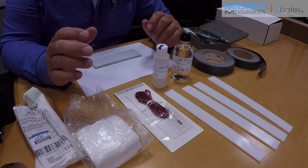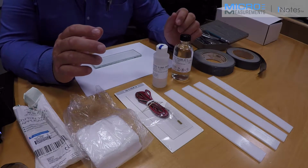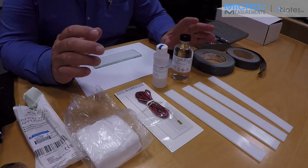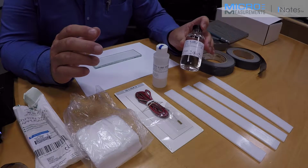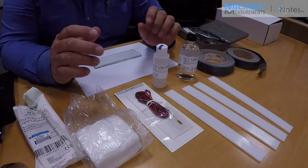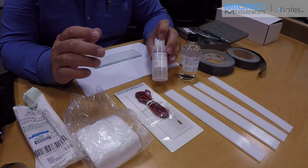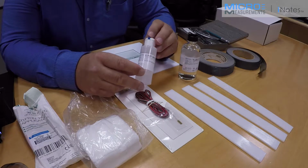materials laid out that are going to be necessary for the surface prep. Plastics, being sensitive to solvents, typically get degreased carefully with isopropyl alcohol. The M-Line GC6 is a perfect choice for that. It's a high-grade, high-purity alcohol. Final cleaning is typically with the M-Prep Neutralizer 5A.